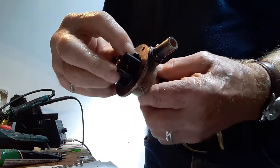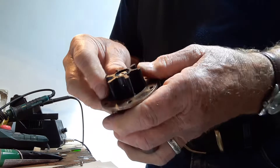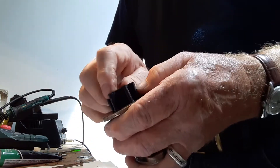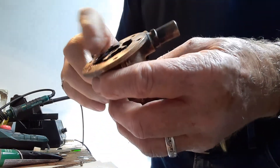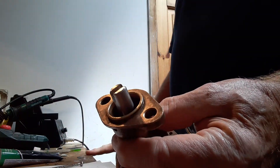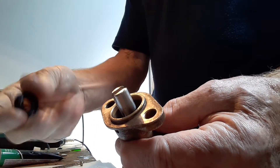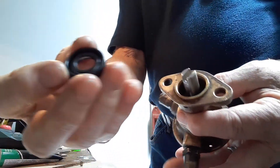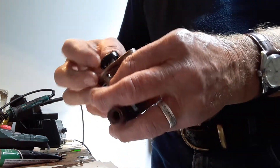Get the impeller in — not easy. Just pop the impeller in so that the shaft just comes proud at the back. Now I'm going to put the oil seals in. The first oil seal goes in with the garter spring — they've got little garter springs in these — facing forwards, to stop water coming back into the pump.